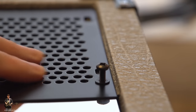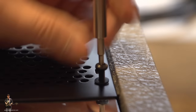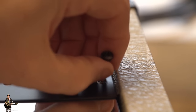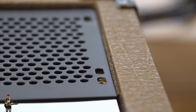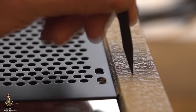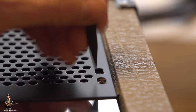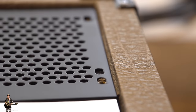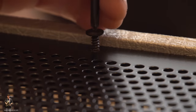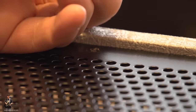As I'm taking the back off here, this back cover, you'll notice that, let's take that last screw out. One of the things that's changed over the years on Marshall amps are these screws. Let me put that out of the way. Now, typically, these screw holes have got a metal insert into the wood, which is really cool. In the old amps, you used to strip out because they were just screwed into wood. But that's only four of the five screws, actually. This one that's here, as you can clearly see, is regular into the wood.